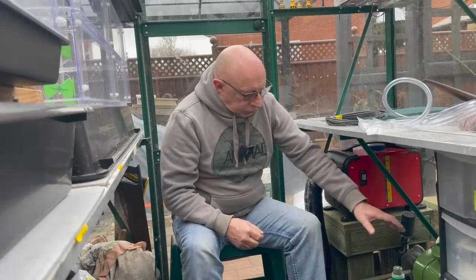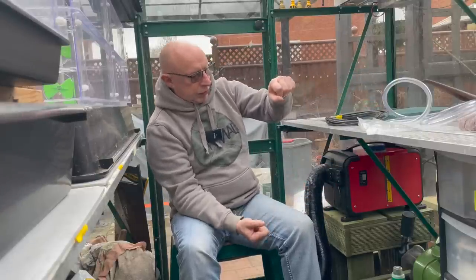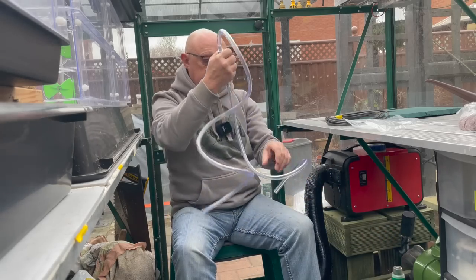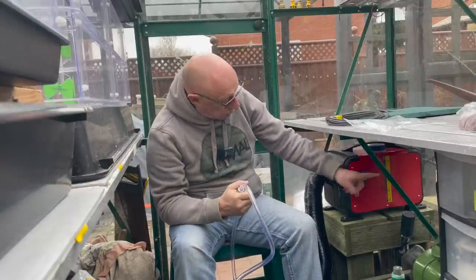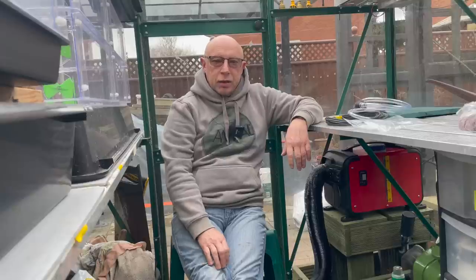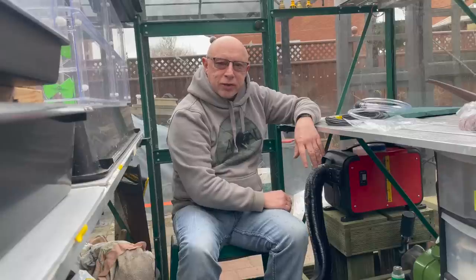On the subject of fueling - I've got a 20-litre jerry can. Originally I was using a funnel through the gap, lifting and tipping the can, which got quite messy. So I've purchased a siphon pump with a one-way valve from the internet. You pop it into the jerry can, hold it higher than the heater's fuel tank, insert the outlet into the heater, squeeze the pump, and watch the fuel rising up the marked tank until it reaches the desired level, then pull it out. We're all set. We've had some mild nights recently but more frost is coming - we're just into February so I expect frosts for at least two more months. So this is on standby. Many thanks for watching, hope you found it useful, see you again soon.